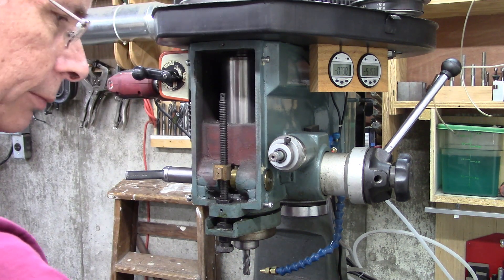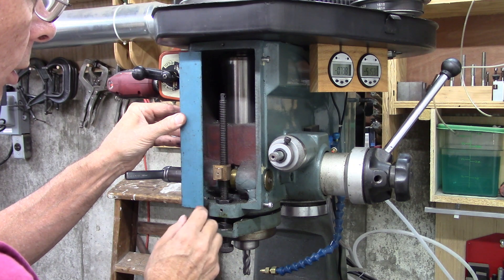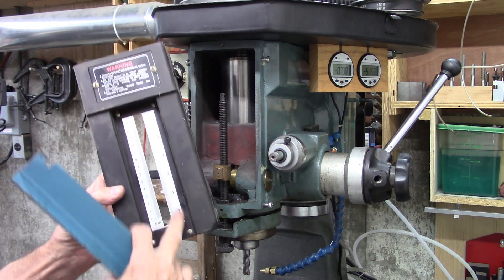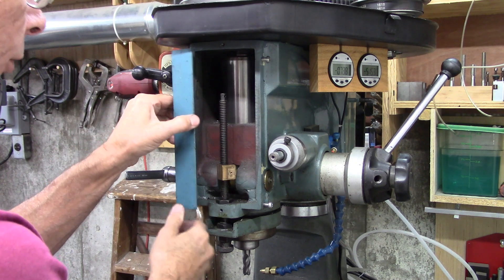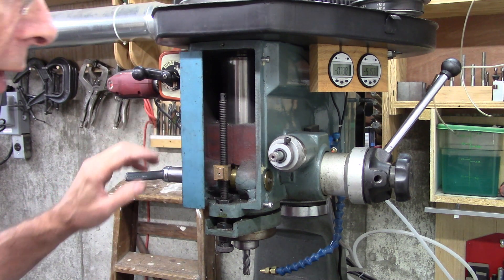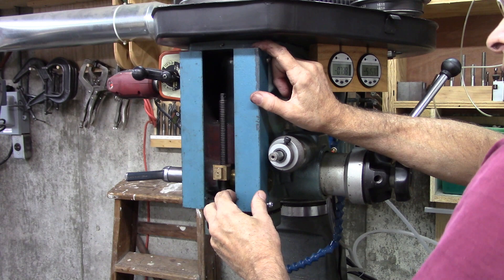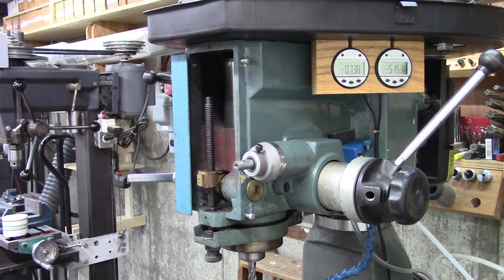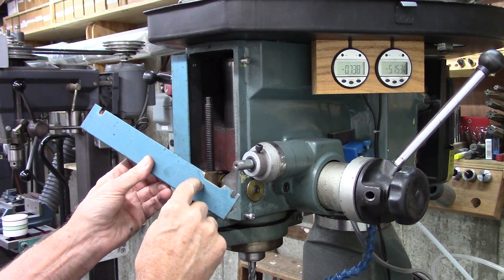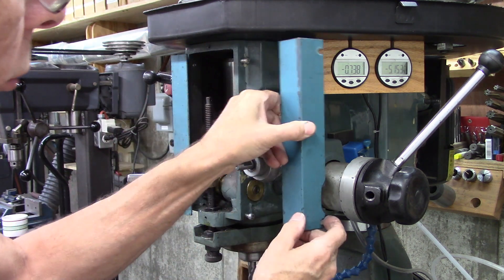But I had these pieces here. I suppose I could put a plate — this plate is screwed onto the plastic here. I can mount these, maybe. I have to do some trimming on that to make it mount at the same depth. What I'm going to do is mill about a quarter inch off of this, but I'm also going to increase these features here one quarter inch. I need that to be one quarter inch further in.